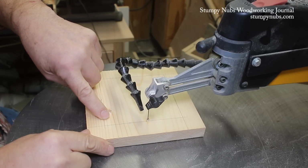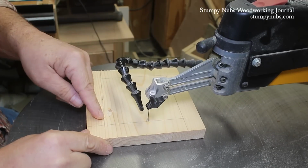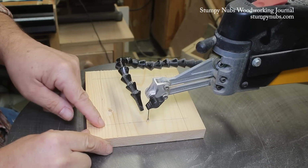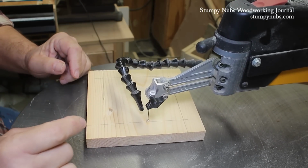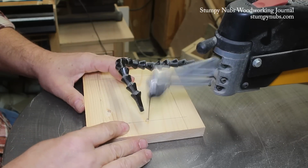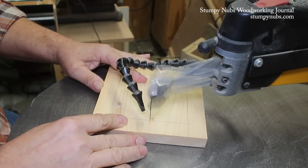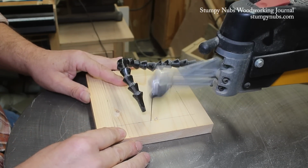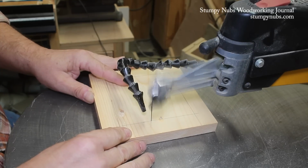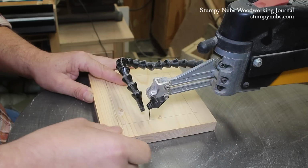As we approach the corner, we're going to treat this cut like you would a jigsaw. You come up to the edge, you go around the corner, line up again with the next straight line. As we go on in future videos, we'll start making those tight snap turns. But at this point, work your way back over to the line, stay just on the inside. Be careful you don't start crossing back and forwards. It's very easy to do.